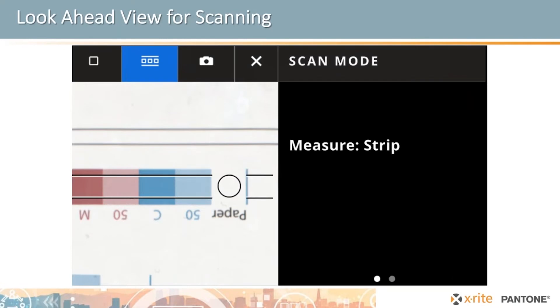Our scanning capability to measure in a strip is greatly improved as well. On previous instruments, we had to line up the chassis with the color bar, lower the instrument, hit the button, and move across. That initial lining-up step was a bit slower. Now, on the screen, your measurement will be where the dot is, and lines represent the direction you'll roll the instrument over the patches. Once you get lined up, you click a brake release to allow rolling, click a button to initiate measurement, and just roll across the patches — it captures all the data very rapidly. You can see you're right on the patches as you're measuring, providing a lot more confidence.